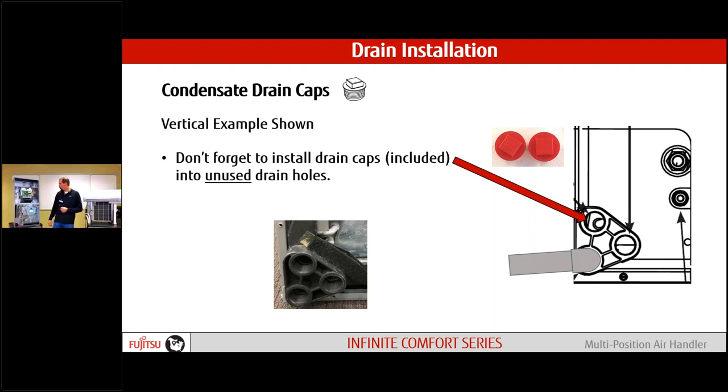Question: what do we do if we have a three-and-a-half ton application? Well, we do our load calc. If we come up with three and a half tons, we can go with a four ton. One of the nice things about this system is the function codes — we have a function code for plus or minus 10% airflow, so we can adjust a four ton and bring the airflow down to match that three-and-a-half ton capacity. That all comes down to sizing and function codes — if you have an application like that, we'll be happy to help you set it up.